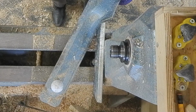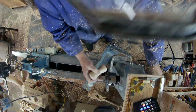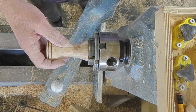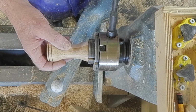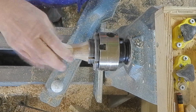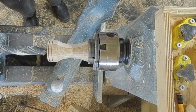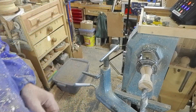And one of the things I found is that when I'm using my Talon chuck, because it happens to be about 50mm jaws, it works perfectly for grabbing this burn line. And that's the reason I put a burn line in, is I put the burn line in about a 1/4 inch, a little better than a 1/4 inch in, and I make the groove big enough that the dovetail on the Talon jaws will grab the workpiece very, very nicely, and it'll be nicely centered as well. So I'll turn the speed down, and we'll proceed to drill it out.